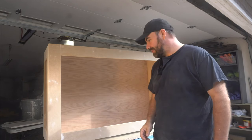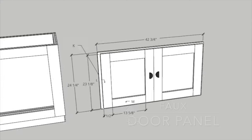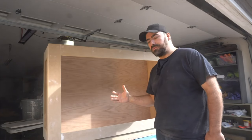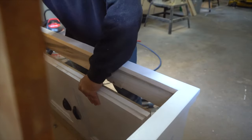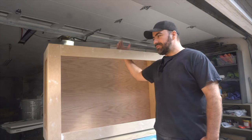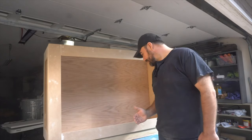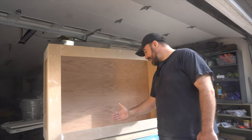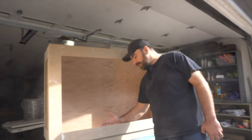I still have to build the panel that's going to go right here. That panel is going to come down from the inside and fit in here, and we're going to do something a little unique — we're going to make this reversible, with one design on the front and another on the back so you can pull it out and reverse it. The reason the panel comes out is so that if you ever need to access the TV lift mechanism you could just pull this panel out. I'm going to put a little ledge in right here so that when the panel slides down it can sit on the face frame but not fall back behind it.